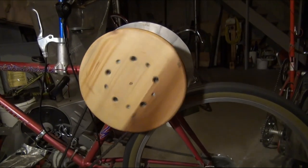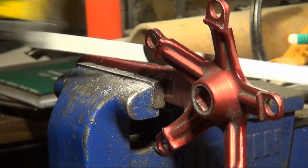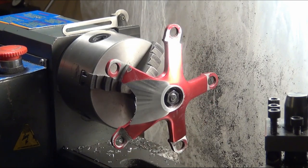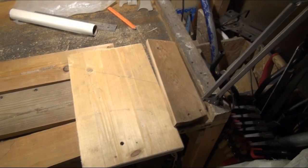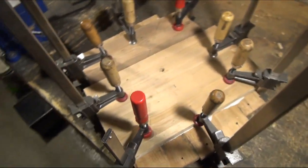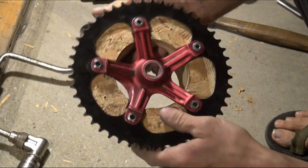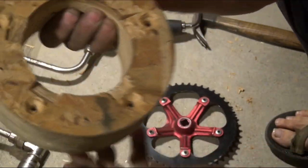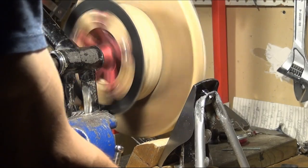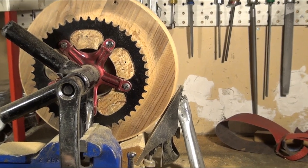For unjamming the blades, a hand wheel has replaced the hand crank, which was hazardous when it was spinning. I cut the crank arm off the spider and cleaned it up on the lathe. Wood scraps were gathered and glued, and the hand wheel and its stem were roughed out. I turned the stem on my lathe and carved it to fit the spider. I turned the hand wheel — which was too big for my electric lathe — using a hand lathe cobbled from a bicycle crank and a hand plane, getting it down to within about a millimeter in diameter.